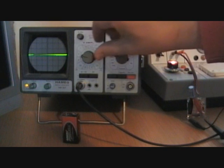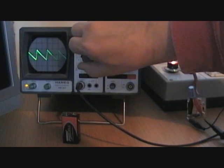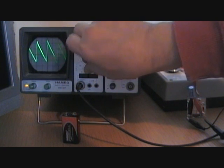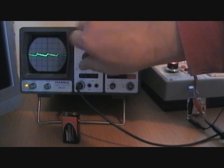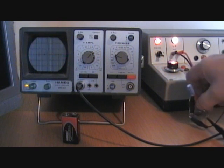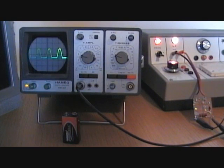Go back to 2 volts per division — that's not a huge amount — but if we slot increase it you can see it looks quite horrendous, so we couldn't really use that like that. But it does join up the dots quite well. If we take the capacitor away you can see the waveform is actually quite spiky, back to where we were originally.